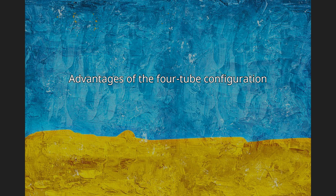RCA engineers in 1964 considered that registration tolerances could be relaxed by 3 times relative to a three-tube camera. A later study by the BBC comparing three- and four-tube arrangements concluded that tolerances could be relaxed by at least 2:1 in the four-tube case.